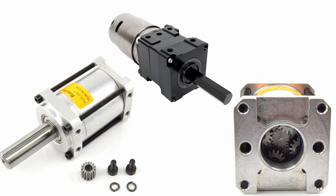Essentially, what you do is buy an expensive gearbox, put whatever pinion gear that gearbox needs on the shaft of the motor, find a way to secure the motor to the gearbox with some sort of mounting plate, and then you have a really nice robust shaft on the output. You get an extremely high reduction in a fairly compact package through planetary gear reductions, and because you can stack the reductions, you can usually replace reductions within a single stage within a certain range. Like on the Versaplanetaries, you can buy stages from 3-to-1 up to 10-to-1 per stage, so you could get a 100-to-1 gearbox that's two-stage, or a single-stage that's a little shorter and lighter.